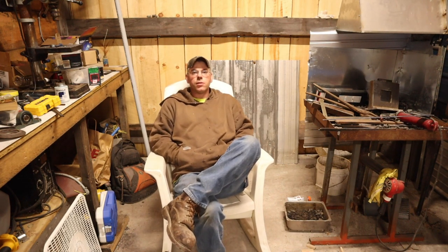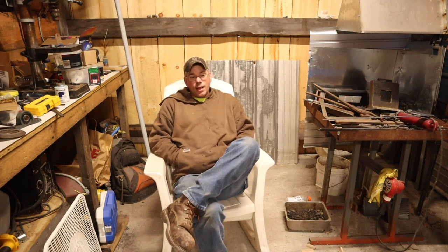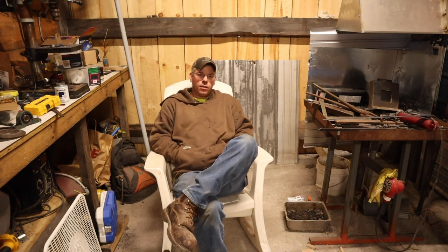You've got to be careful though. It's very easy to go too far and wreck it. But as you can see, right after we finished welding, I showed you guys that temperature probe maybe 2 minutes, if that, after the last weld. The last arc was struck, and I put the probe right on the welds.